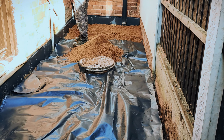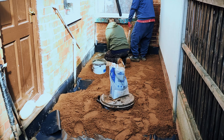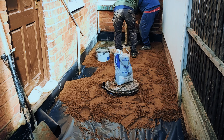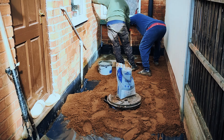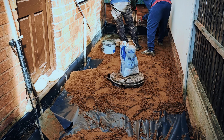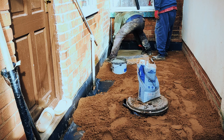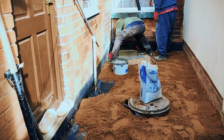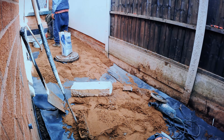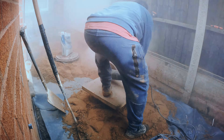The reason for the plastic sheet under the slabs is it stops weeds from going from the ground up through the slabs or patio cracks and gaps. It's very important to do this at this stage — a lot of builders will skip it and just put slabs down on a bit of sand without the plastic sheet. Without it, weeds will grow from below ground up through over time. With the plastic sheet, nothing can grow from underneath; anything that grows will only be in the cracks of the cement where the slabs join up.